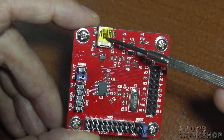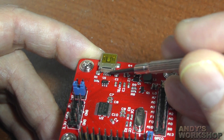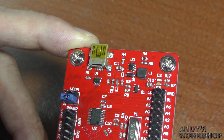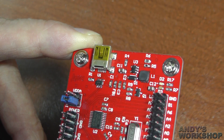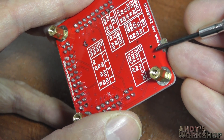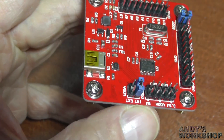A quick mention of the USB pin header — I did that one in the oven as well because it's a large surface mount device. It helps to do it in the oven because the little pins underneath are quite hard to reach. It may look like this surface mount connector is prone to being pushed off the board by the insertion force of repeatedly inserting and removing a USB plug, but this footprint has two small holes that correspond to plastic pins on the plug that poke down and give the connector some reinforcement against damage from repeated USB insertion.